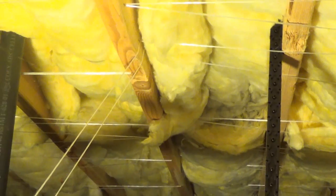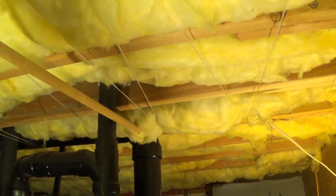I went ahead and moved the insulation away. You can see this pipe coming down here and another pipe coming down there — those should be in line with the wall. I'll use this stick on either side of the pipes so I know generally where to drill. The first hole will be about here and the other one on the other side of that joist. With these holes drilled, I peeked up and saw light right above the tiny holes from the top — so they're perfectly aligned. I could basically just drop a weight straight down and maybe use a magnet to grab it on this side and pull it through as a fish line.